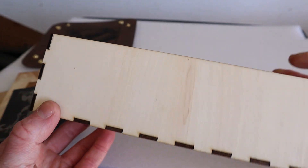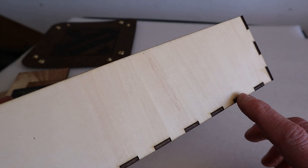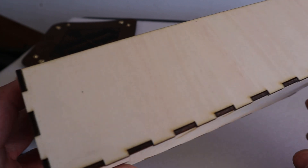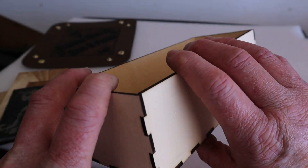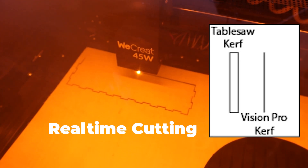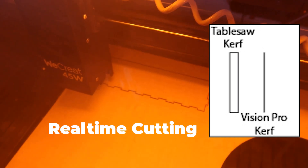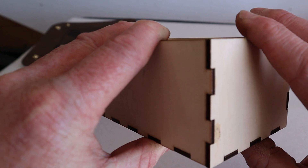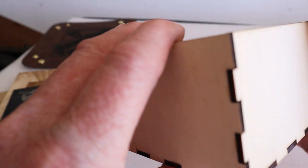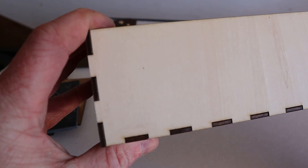I also cut out a box on the laser. I always like to check out the kerf. The kerf — for anybody that does not know — has to do with the amount of material that is removed when you cut through something. And the kerf for this laser is .08 by .08, and you're going to lose that much material when you cut. By comparison, on a standard table saw it's about an eighth of an inch. So a laser kerf is very, very thin. And when you do a box joint like this, it's important to have really good accuracy for those joints to fit together. I see basically zero gap in between those fingers there, which means the accuracy of the laser and my file were pretty good.